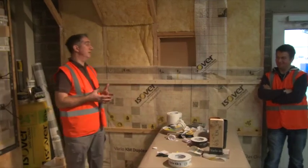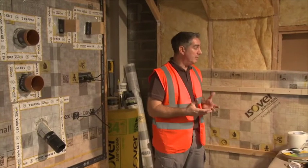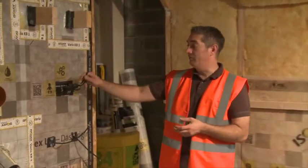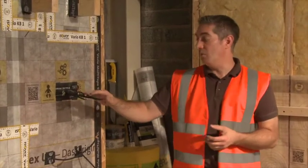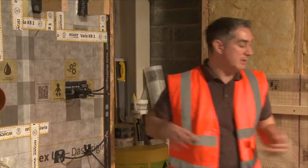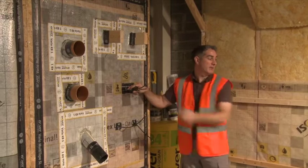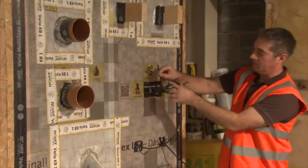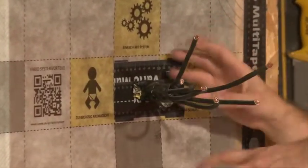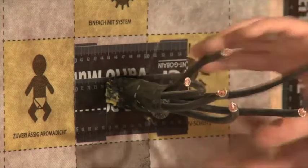You have to do the detailing to the best of your ability, adopting the principles for cable penetrations — sealing around the back of the box to minimize air leakage where we've got multiple cables coming through. I've put six cables through this hole here, and we've replicated this type of detail but with a larger section, joining sections of tape together to make a wider section and wrap it around. You'll notice if I splay this open that we've also addressed the air leakage through the cables themselves — once we've got the detail around the outside, we pump sealant inside the actual cables and then wrap them all together as one unit.